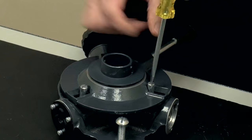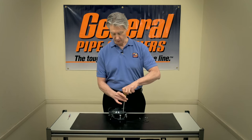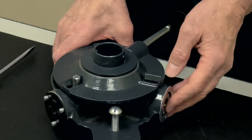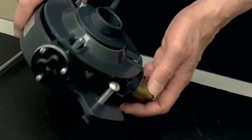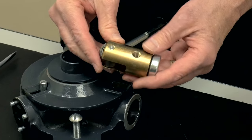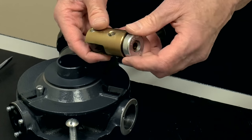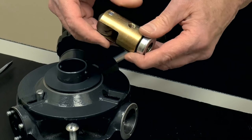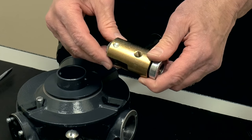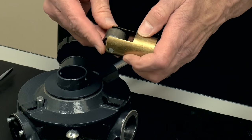Next, loosen the swing pin — they unscrew the same way. Once you've taken off the disc and removed the swing pin, the whole carrier will come out in your hand. Notice that you have a roller bearing on one side and a thrust bearing on the other to help it rotate. Right there is the screw where the swing pin is inserted. So we're going to put our attention on the feed roller bearing.